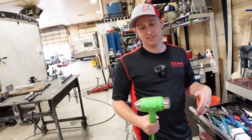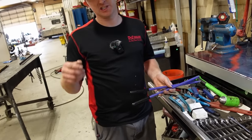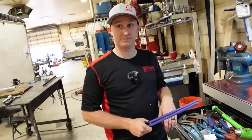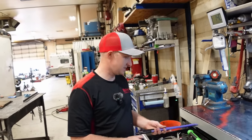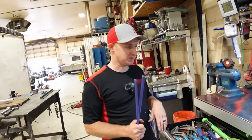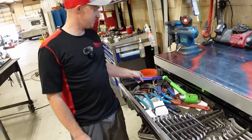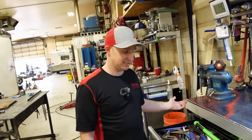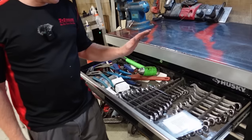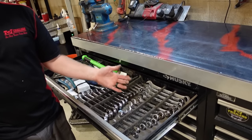In a metal shop the big hammer comes in handy for body damage and twisted metal. He also has bars for adjusting the cable systems on the back of a trailer — the ramp door spring cams. You put the bar in and adjust the round springs on the rod — it can be dangerous if you don't have the right tools or know what you're doing. He also has wrenches, mostly standard since trailers use standard half-inch bolts rather than metric.